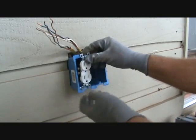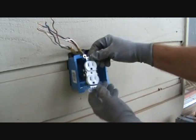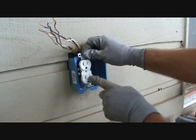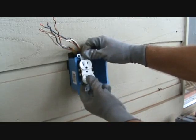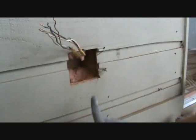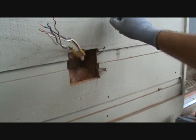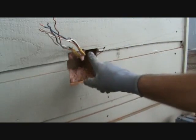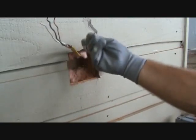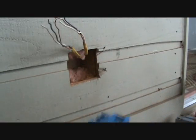This new plug is going to be controlled by a light switch that's going to be on the other side of this wall, and it's just going to control the bottom of this outlet. So from here, we've got to go up to a light switch, up this way with the wire, and then from that light switch, we have to come back down too. So we've not only got one wire going up — it's going to look just like one of these — we've also got another wire coming down.